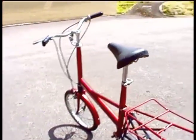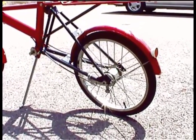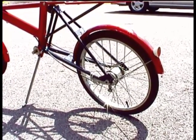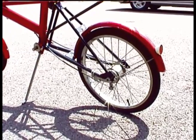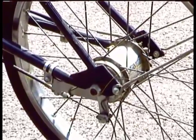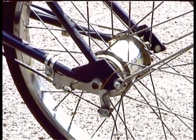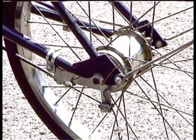And it's worth just looking down at the gear here, because this was the small diameter hub brake 3-speed, the S3B, which was brought out by Sturmey Archer specifically for small wheel bikes. It was also used on the Mark III RSW. Not the most effective of hub brakes, it has to be said, and some problems with oil seals, but an interesting design.